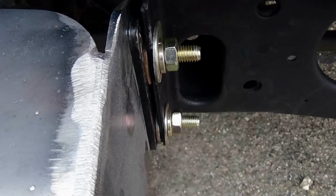That fit up I mentioned a couple times where I wasn't sure if that plate was supposed to go over a little more where the lugs were. In hindsight, I definitely would butt those up to eliminate the gap, but also to tighten it up a bit, because I don't really like doing this, but I ended up putting some washers in where I actually bolted it to those brackets to hold it on, because there's just a little bit of play, again, about the thickness of the metal. So that tells me that it'd be better to move those closer together before you weld it. And then on the top of that, I would bevel that or grind that back a little bit so you could get the nice corner joint on there to fill it up nice.